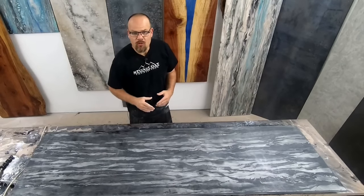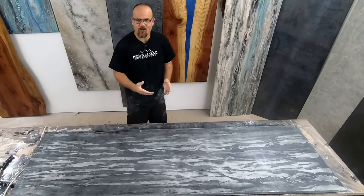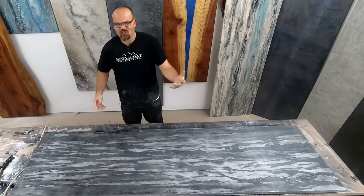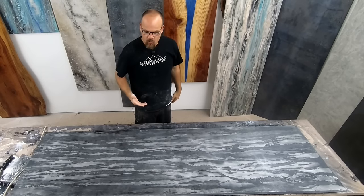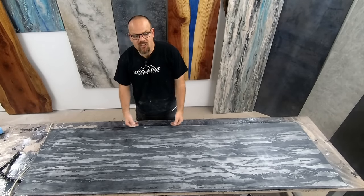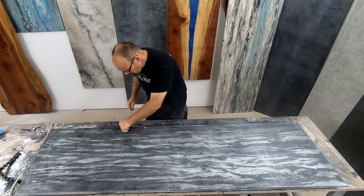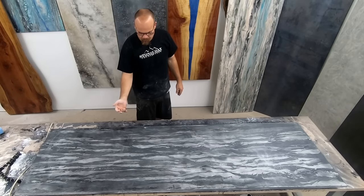Often on a job, you won't need to start as low as 220 grit. You can start at 600 grit or higher, depending on what you're trying to remove. If you came back to a job a couple of years later with wear and scratches to remove, you'd want to start lower than that deepest scratch and then work your way back up. Here we're showing 220 grit as a worst-case scenario and bringing it back up to show the polish achievable with our top coat. So we did 220 on top, then the edges with 220, then finished by hand on the coves. When you do the edges, turn your sander down and just remove any voids — when you rub your hand on it, it should feel really smooth, but don't go too deep and burn through that edge.